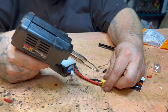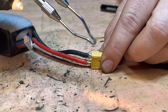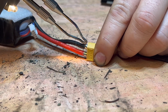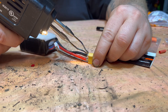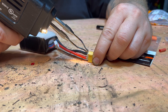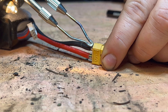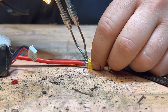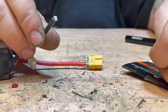We're gonna take the negative one first. Pull the trigger when the light's on — it's engaged. Just hold it up to it. Takes a few seconds. It's gonna heat up the whole connector and the wire at the same time to undo that soldering. You'll start to see the solder become liquid again. Just like that — the old wire with soldering comes out.